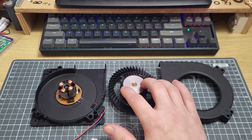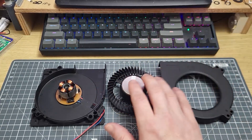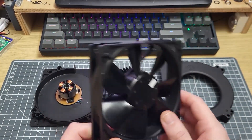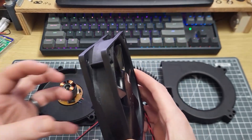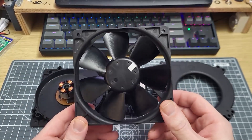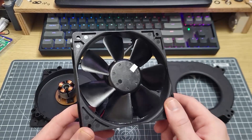When you completely close the outlet, the blower is free to spin really fast with very little power draw because there's no airflow — there's nothing for it to do anymore. This is vastly different from an axial fan. The axial fan has to spin against the pressure of the enclosure that is pushing against it; this is called back pressure. And that's why axial fans tend not to be used in air conditioning — they're just not good at developing pressure.